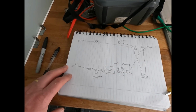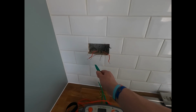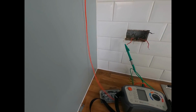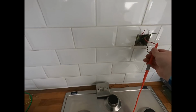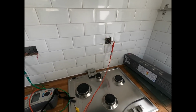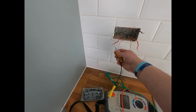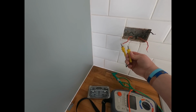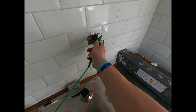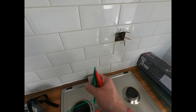So what we've done is I've used continuity. So either I can do R2, so what I'll do is I'll connect, for example, one to the line on continuity test, another one to the line over there. If you reach it, then I'll just check that so we know what way the cable's going. If I can't do that, then what I'm doing is I'll link out the R1, R2 like so, and then test R1, R2 over here, for example. Okay. Test is not on, so it won't make a bell or anything. So that's how I'm finding this out.